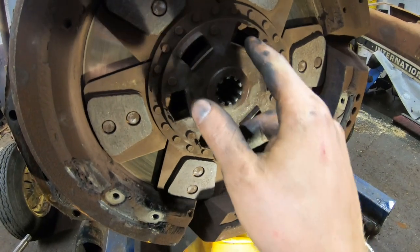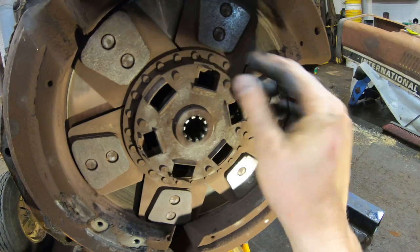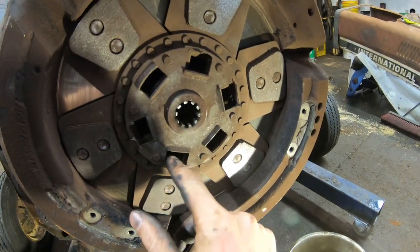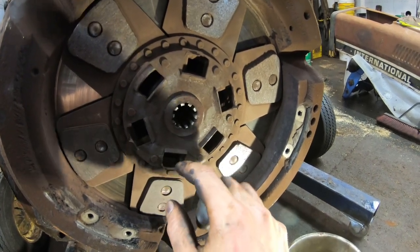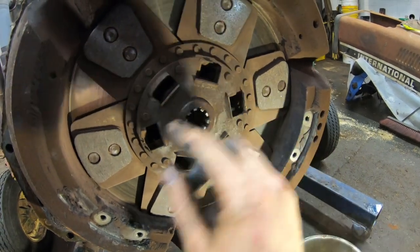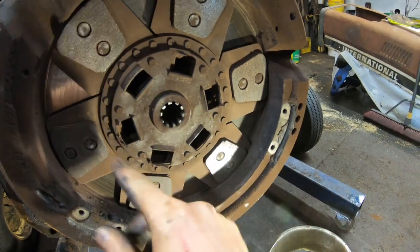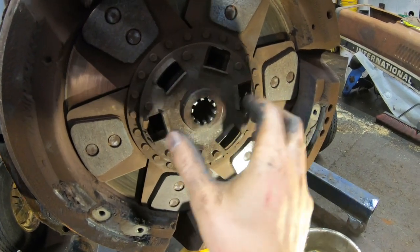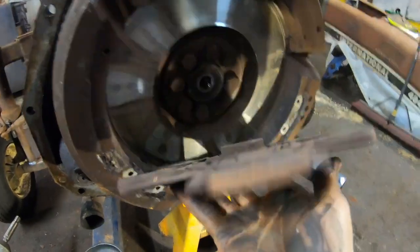But anyways, these springs go here. That's all worn out thin. I don't know, must be they were vibrating in place and centrifugal force is driving the springs outwards, and that's why the outward side of this thing is all worn super thin. This one probably fell out because all the other ones were gone, and then this whole thing was focusing on the one spring. I was expecting a lot worse. I guess that's all I'm trying to get at.